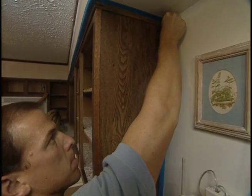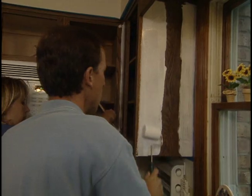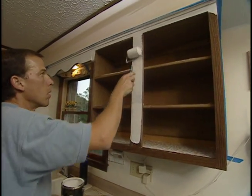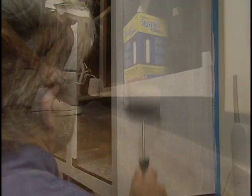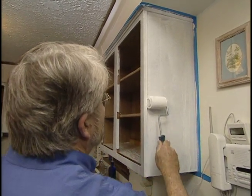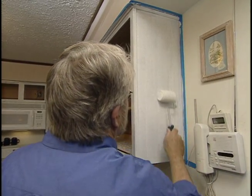While the primer is drying, we go back inside to start work on the cabinets. We begin by applying masking tape to cover the walls. We could spray these cabinets, but if we do that we've got to mask everything off — I think it's a little more trouble than it's worth. So we're going to do this with brush and roller. A two-inch sash brush is used to prime the edges of the cabinets where they meet the ceiling and walls. The cabinet ends are covered quickly using a short-nap three-inch roller. The roller is also used to apply paint to the cabinet fronts, or face frames as they're called — nice straight strokes top to bottom. For hard-to-reach tight areas it's back to the brush, but for covering ground quickly it's the roller. Once you've rolled a surface, come back and do what's called striking off: take your roller, begin at the top and go all the way to the bottom in one long stroke. This takes out any roller marks and leaves you with a smooth, clean, professional-looking surface.